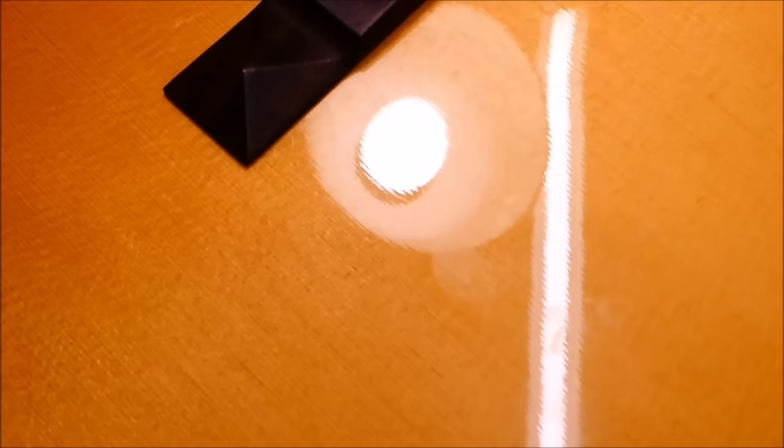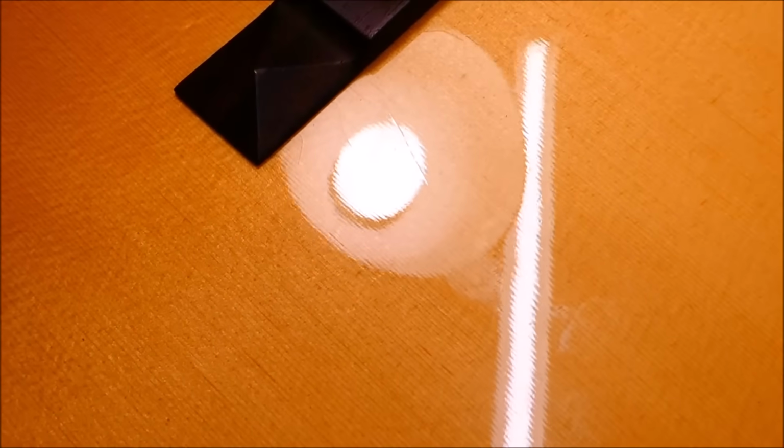But fixing them usually isn't feasible because they go all the way down to the wood surface and it could be a real mess trying to make them go away. You'd have to either dissolve or fill the lacquer and then sand everything flat again and rebuff it. It's usually best to just sort of let sleeping dogs lie and realize that in 30 years this thing is going to start cracking all over like an old Gibson anyway.